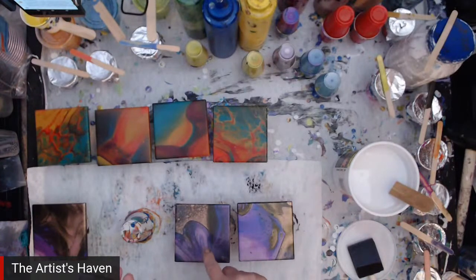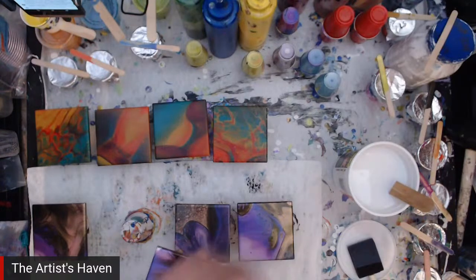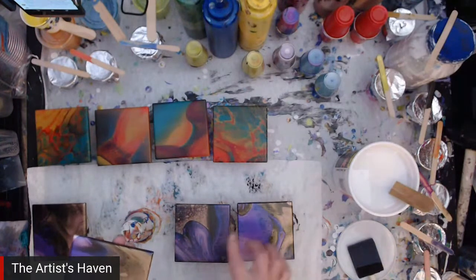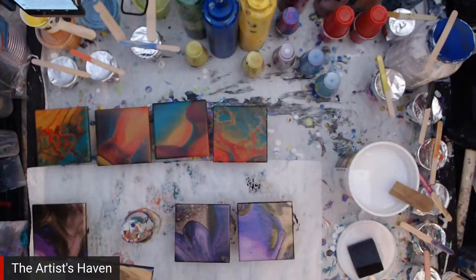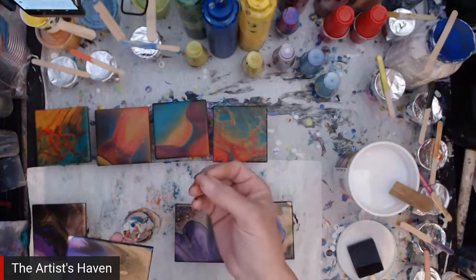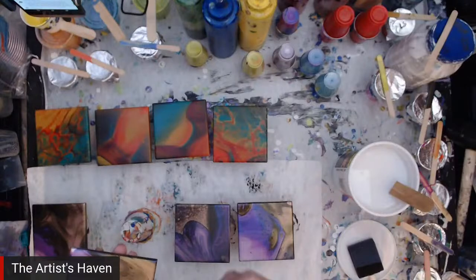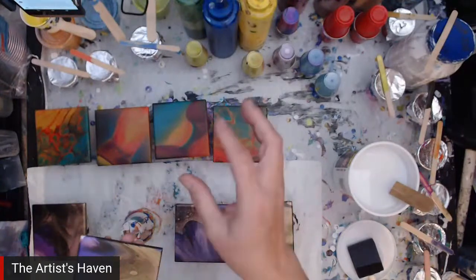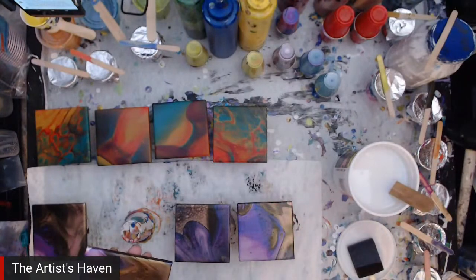This will be a thinner coat than if you pour a little bit and just kind of roll it around like paint, or even if you put a little puddle in there and spread it out with the brush. You're going to get a thinner coat with this, and you're less likely to have crazing, cracking, and all of that, because polycrylic is made to dry fast. And if you've got a really thick coat on, it can't, and it's going to crack. So you're better off taking the time to just gently brush it on.